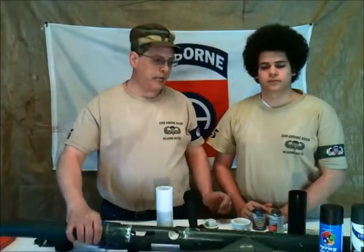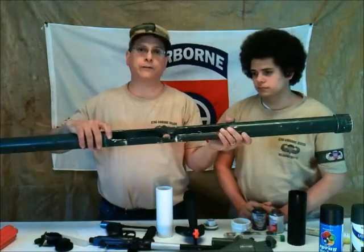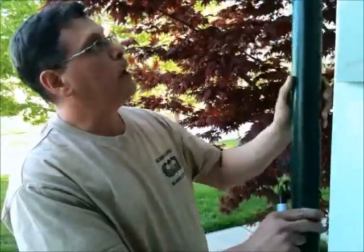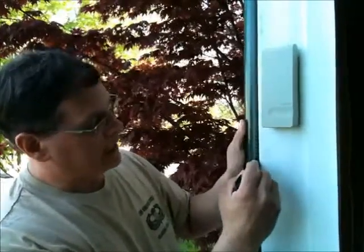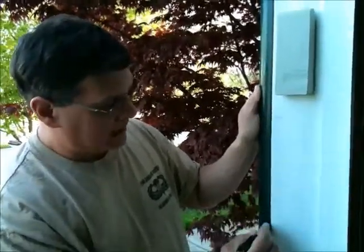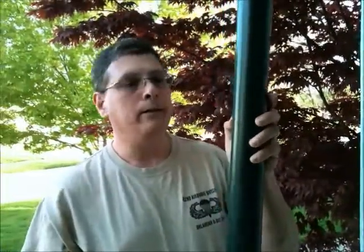The next step is to cut a slot in the bottom of your tube so your marker will fit into it. This will vary depending on different markers, but I usually find an inch to inch-and-a-quarter wide slot will suffice. To lay out your lines, put your tube up against a door jamb, take your marker or pen and draw a line, rotate it about an inch, draw another line, and there you have your layout lines. Then drill using a decent-sized drill bit to give you large-radius corners.